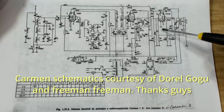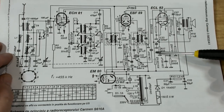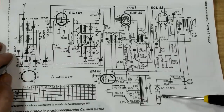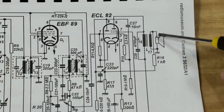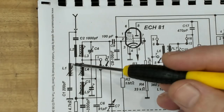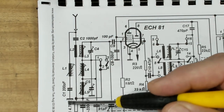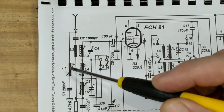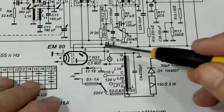I have a number of circuit diagrams. One clearer version has replaced the EZ80 with a 1N4007 diode and a dropping resistor, which I'll use for explanation. The disconnected red wire is either going to ground or back to the cathode for negative feedback. The coil I found is an IF drain - it drains any 455 kHz signal coming in through the antenna so it doesn't interfere. I may just leave that disconnected since it's not needed anymore.